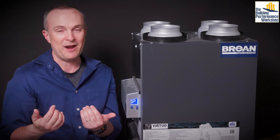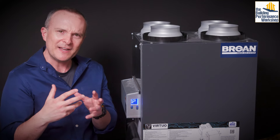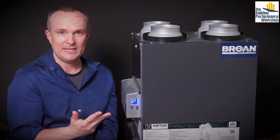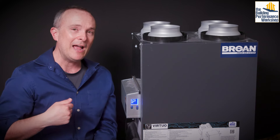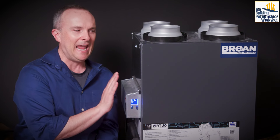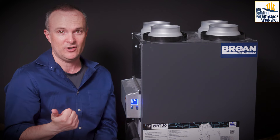Basically I recommend T1, T2, T3 in real-life applications because we have to use it as a bath exhaust. T4 and T5 I would use if I wanted to trick this thing into not recirculating if we had that 23-degree situation happen, because I still need to use my exhaust. If you have a fireplace in your house — I warned you — at that point it's going to probably start backdrafting because your house might be so tight.